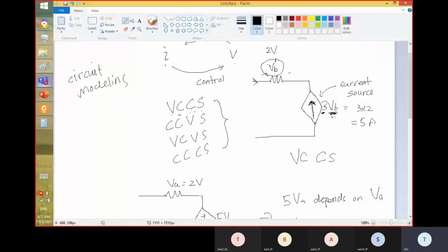You don't need to measure it actually. For example, in a power transmission line, let's say you have a cable stretched across 2 kilometers, and you know the resistivity given by the supplier. The resistivity is constant for a certain material. Copper is very common, and copper has a fixed resistivity. If you know this and your diameter, you can calculate the total ohms from this point to this point. What is the total ohm in the line? You can use this equation. So sometimes it's quite helpful.